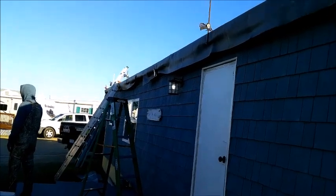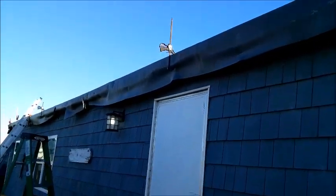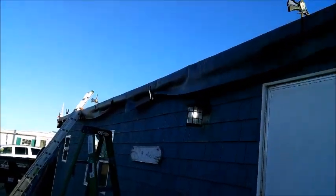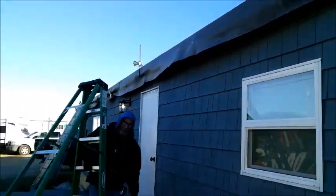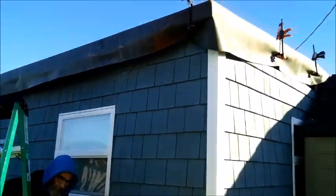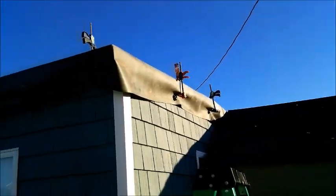All right, day two. When we left here yesterday, it was windy down in Kitty Hawk. We clamped it all off, so we just ran the rubber over and clamped it off for the night, and that's what we did. Don't have much of an overhang on this end because of that building. The overhang on the other is 6 inches. This is going to look sweet here in just a few hours. Get ready to start the pressure board all the way down through here.